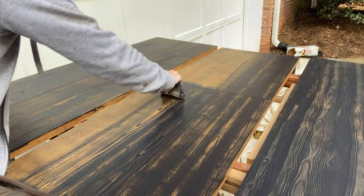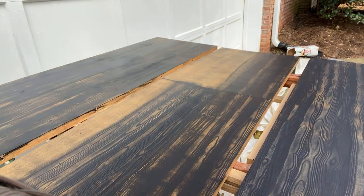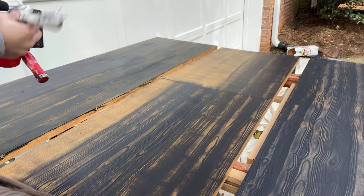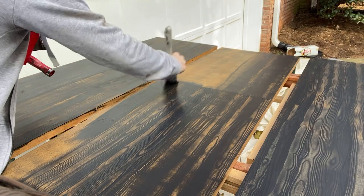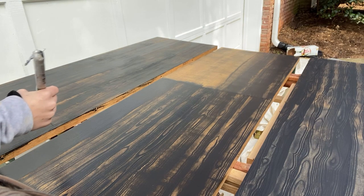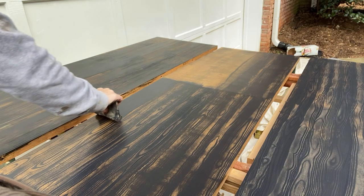On that spot I just did, I actually repainted over it because I didn't like how it looked — painted over it again and then used the graining tool again. You can see when I use the foam roller it just blackens everything up and makes the table look like it was stained black instead of dramatic contrast. The more you sand your table, the more the paint will absorb and you'll get a very black-looking base instead of brown peeking through — it'll be more like black and gray peeking through.